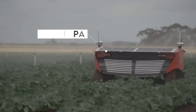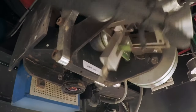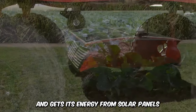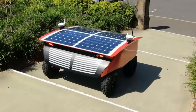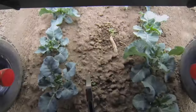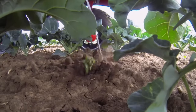Here's an interesting sensory farm robot called Ripa. The robot gathers intelligence and automates precision operations, using its sensors to find weeds and foreign objects and gets rid of them. Ripa weighs about 550 pounds and gets its energy from solar panels, meaning that it can work all day long under the scorching sun. The sophisticated algorithm of this machine enables it to distinguish the features of cultivated plants from weeds and foreign objects, and it takes its time to manually remove the weeds and objects with precision and 99% accuracy.